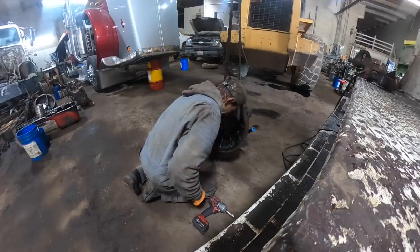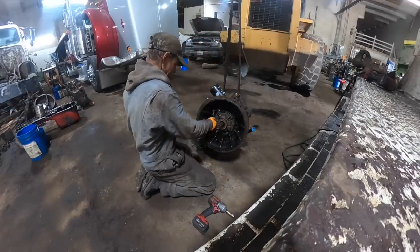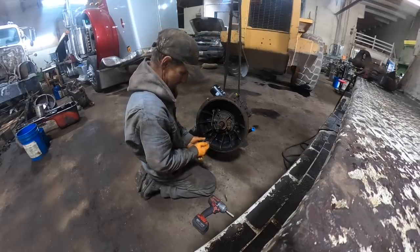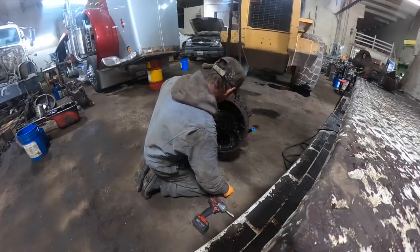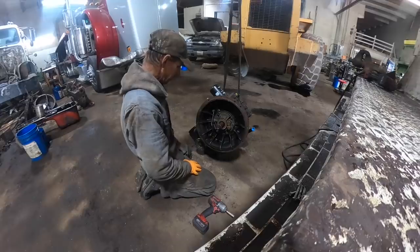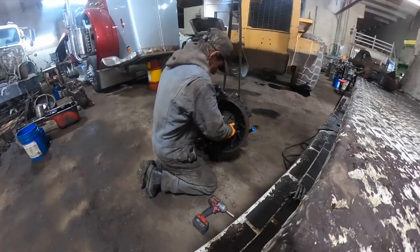I'm gonna clear that. The Isuzu engine over there, I'll have to show you. It broke a ringland groove is what it did. And broke the aluminum crown of the piston is what happened on it.